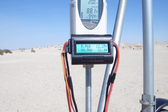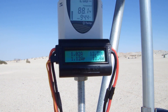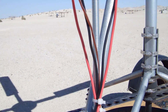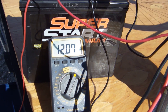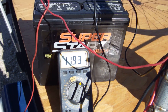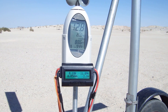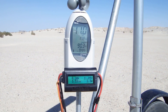The meter on the battery confirms the voltage reading at the watt meter. The readings jump around a bit because the generator output will once in a while drop below the battery voltage depending on the changing wind speed, and also because the generator output is unfiltered. So what's my vision here? For starters, unless you're on some acreage, wind turbines aren't great for the home market. This type of wind turbine will do best scaled up to commercial wind farm applications to bring the cost of generating electricity down to reasonable levels.